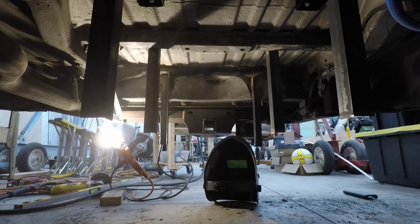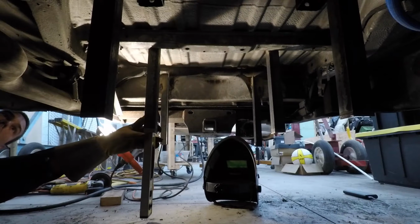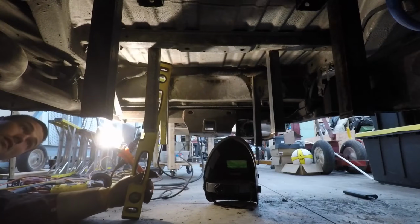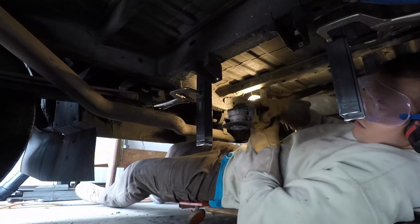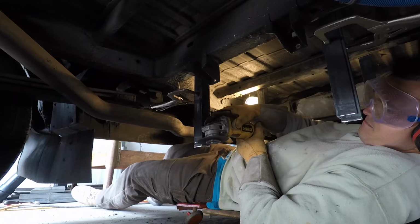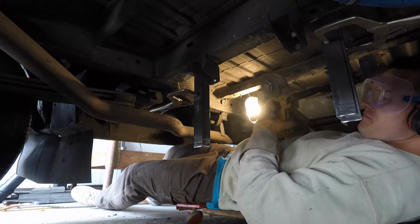Here are all 6 of the vertical supports welded into place. Running out of room under there, but still managing to get the job done. I left all of those supports a little bit long so that I can trim them down after they were in place. This ensured that I would have a level rack even if the bottom of the van wasn't exactly level.